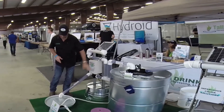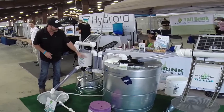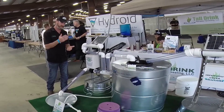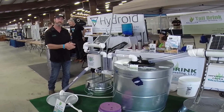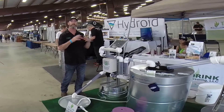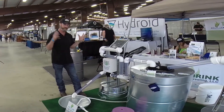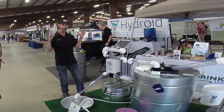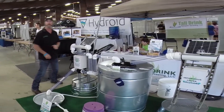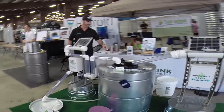You've got the first flush, and you've got all your conveyance — but it's now going to hold that lock for 12 hours. It starts that 12-hour clock when the rain stops. Now if the rain starts again, it's going to reset that clock. It keeps doing that until there's no more rain activity for a 12-hour period. When that valve opens up, all the water flushes through the conveyance system.